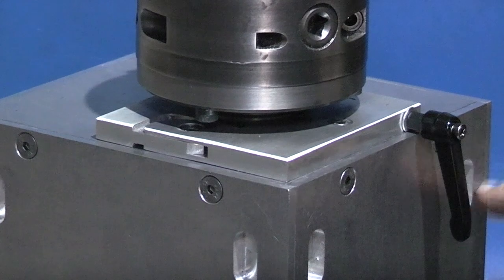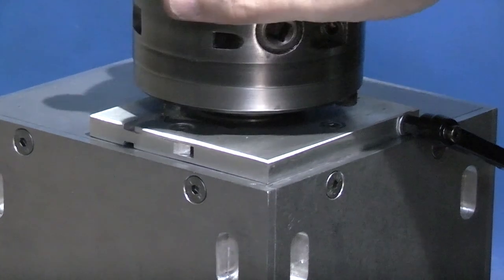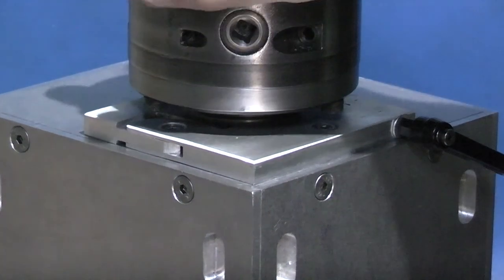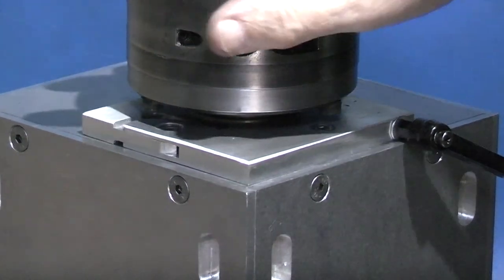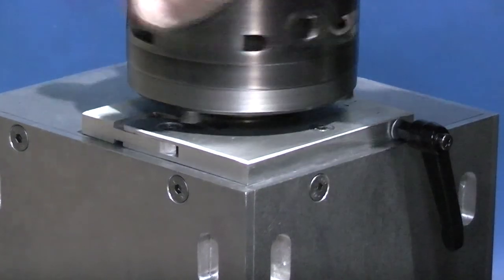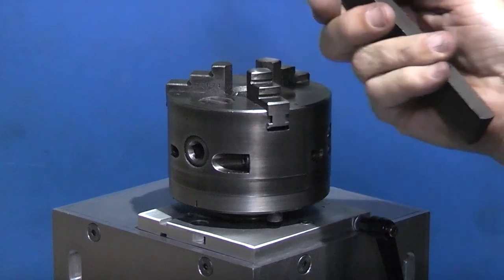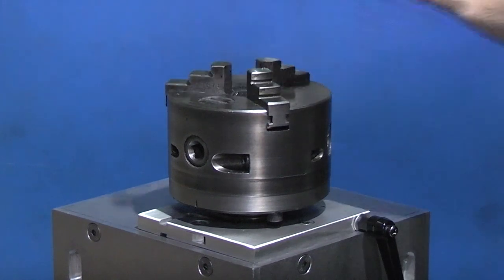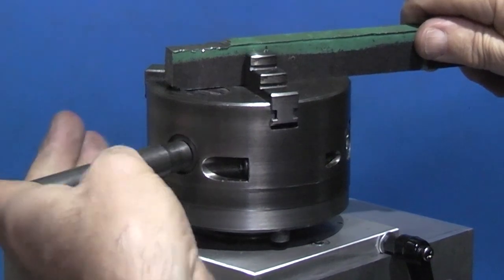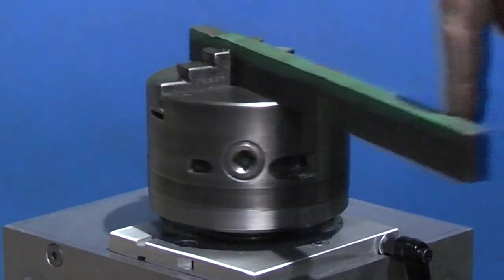Turn the clamp. That's grip, you can see it's turning the whole thing. That's just started to grip. In fact, if I back it off, it's undoing the chuck. Quarter of a turn, and it's free. Let's get some pressure behind that. I've got a piece of steel which I'm just putting across the chuck jaws as a lever. Tighten that up on the chuck. That's off. You can see now, turn that with one finger.